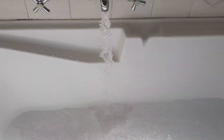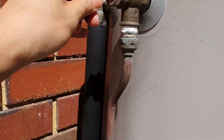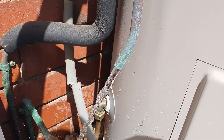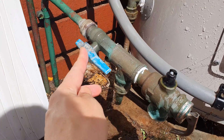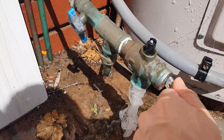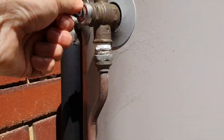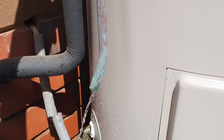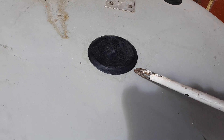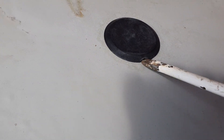Turn on all the hot water inside your house. Outside of the tank there is also a relief valve that you can turn on, and this will relieve the pressure inside your system. There is also an isolation valve that you can switch off — that is the cold water coming into your system. Turn that off and then try to relieve some water by using the relief valve on the side of the tank.